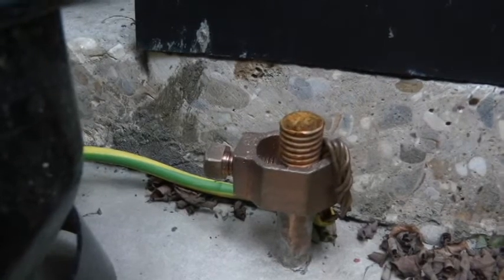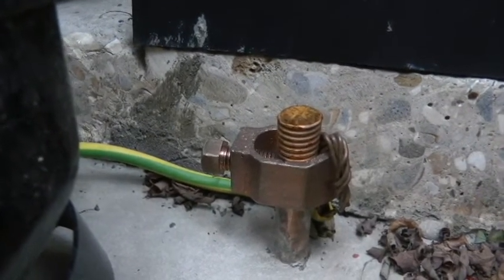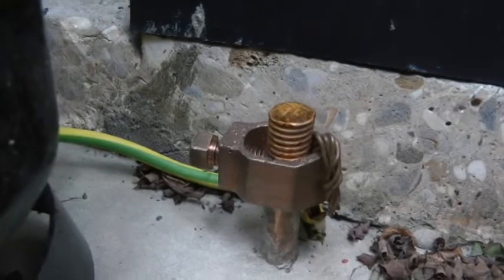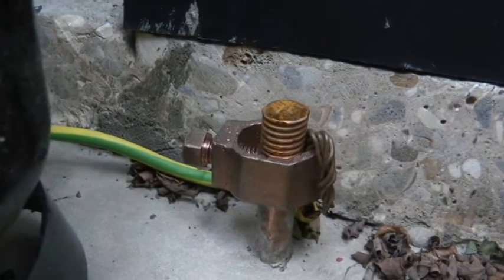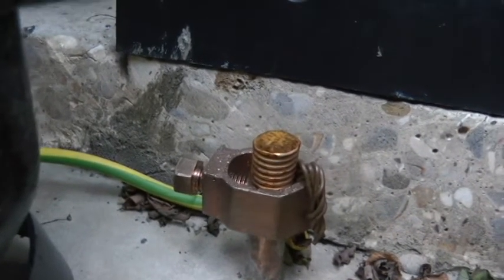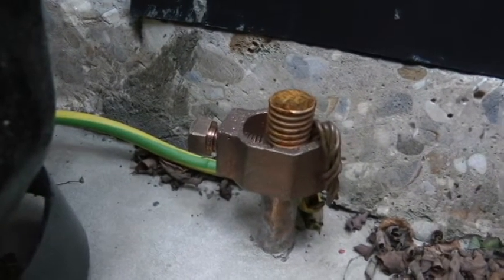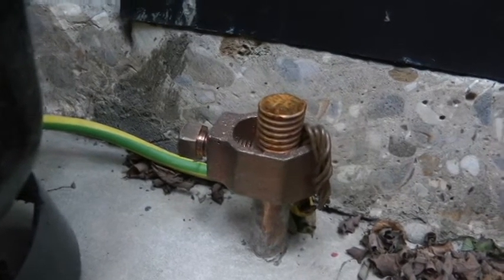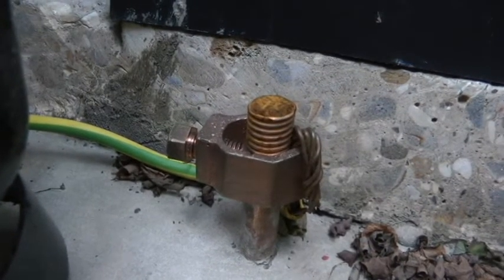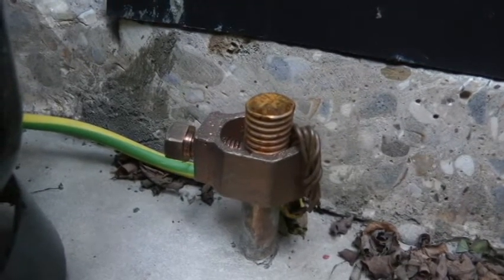You don't have to, but you can put that nut on the final piece so you're not ruining the screw thread of the last section. Then just screw the copper fixing on and fix your earth strap into that. That connection also goes into the electric box as well, so I hope I've got every angle covered — and we'll see what it works like.